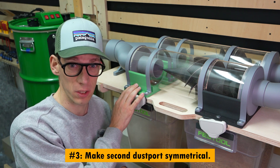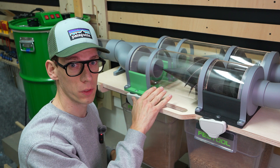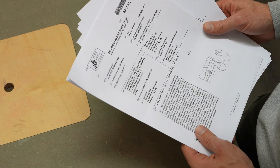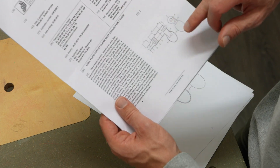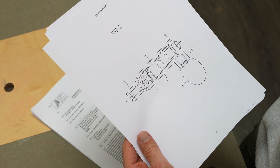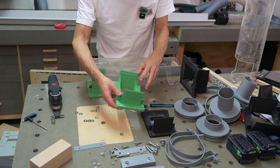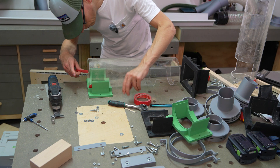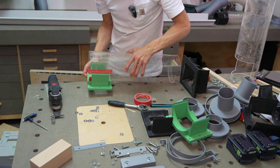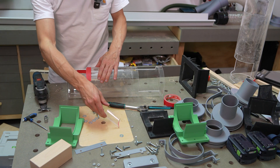Changing the second dust port to a more symmetrical design was something I wanted to fix myself. In tests with high feed rates, material was left on the bottom of the tube and was not able to fall into the second dust bin. While redesigning I was inspired by a European pattern of a single-stage separator with an asymmetrical dust outlet port. I copied that, but now I think a symmetrical design is the better option. You can see the difference between the old and new symmetrical outlet. I needed to take apart the whole separator because the cutouts in the tube needed to be enlarged. For those who already printed my separator, I made a new cutting jig so you can properly mark the new cutting lines.